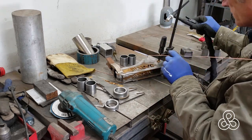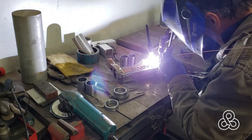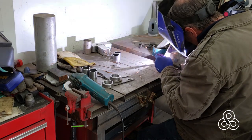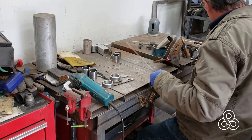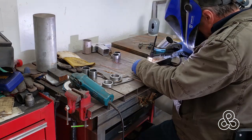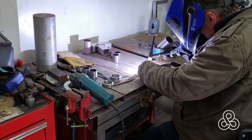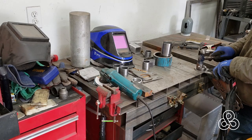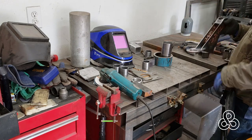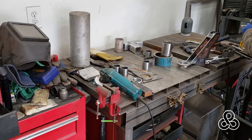Those were all beveled off-camera a little bit to give me some gap for penetration on these welds. Once that little tab in the center is welded, I can take the clamps apart — everything should hold together just fine. Then I'm able to position it a little bit better. This assembly is made out of two pieces of heavier sheet metal and a quarter inch steel plate, with bushings on one end and the ball joint on the other. The little tab on the end holds the spacing where the shock absorber will hook. The part I turned for the ball joint is a nice fit, but you'll have to hammer it into position so it's nice and flush on one side.